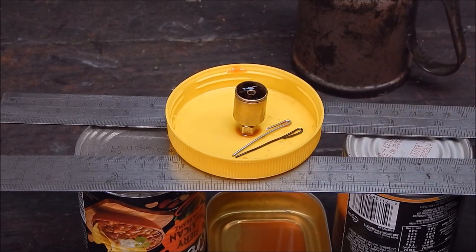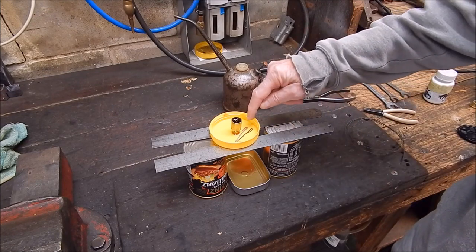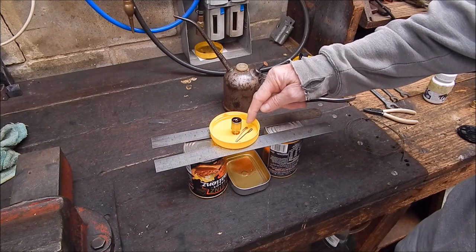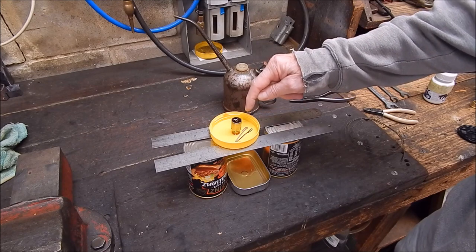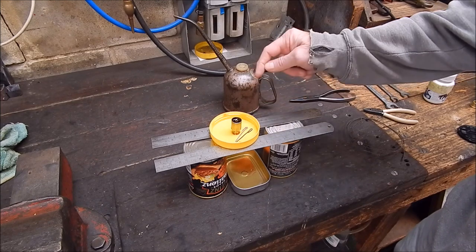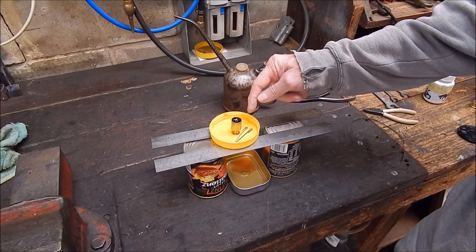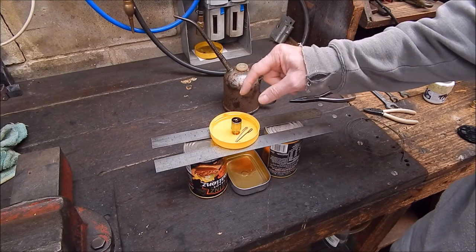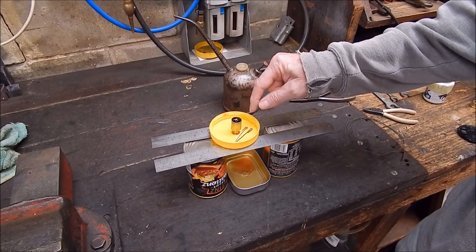Interesting. Well, the video turned out to be a bit more interesting than I expected. I've never come across that issue with the coating on the wire before, and it was just pure luck that I grabbed some of this wire — which I've never used for this application — and found that there's an issue with that coating. So, use plain black wire. You can't go wrong. The drip rate was good. I'm pretty sure in the past I have used copper and it worked okay too. So when you do this, check your drip rate before you run your lathe, just to make sure there's no issues.